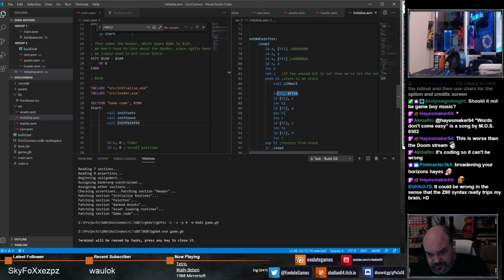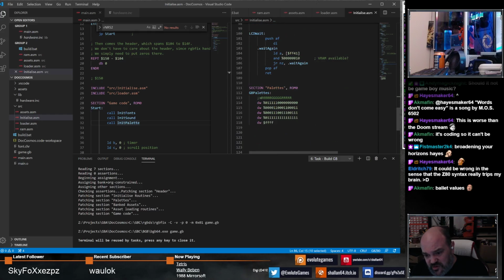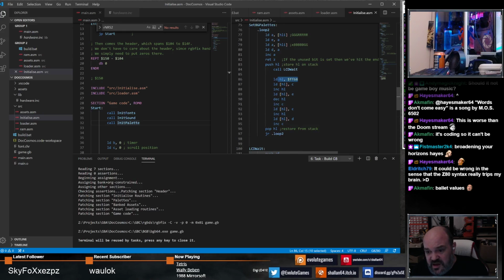And it's doing that by reading the values from the font and incrementing the pointer as it goes along. So it reads these eight values in, and then one by one pushes them into FF69. It actually writes a number into FF68 first, then increments and starts loading values in.